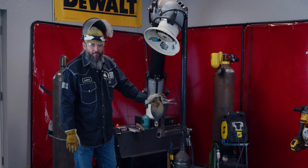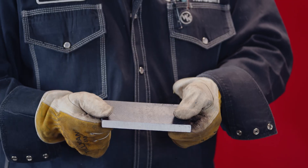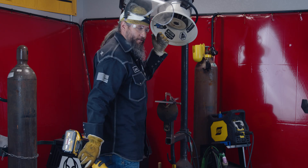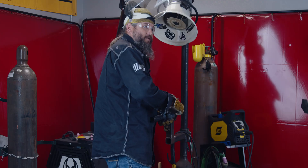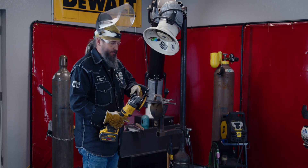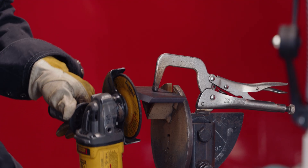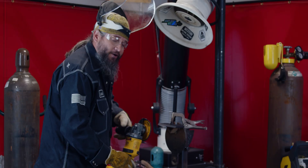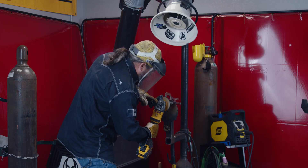The first thing we're going to do is put lands on our knife edges. When you get your coupon it should have a bevel cut on it with a sharp knife edge - we're just going to flat this off. Important reminder: the biggest disqualifier at our weld comp is double eye protection. We're using our eighth-inch grinding disc, you can also use a quarter inch. You want to stay as 90 degrees to your plate as you can - flat land on this - and we're going to take it down to about an eighth of an inch.